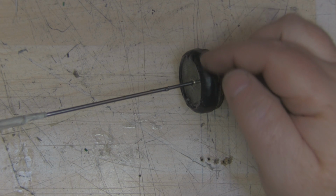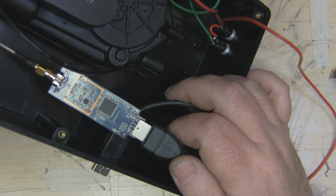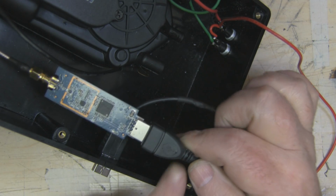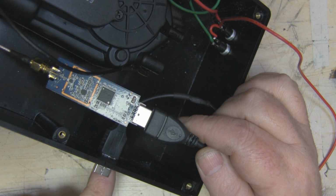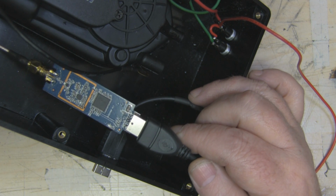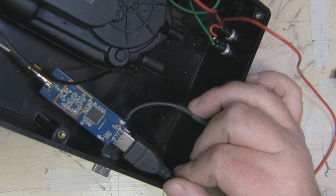What I'm going to do now is put a little bit of epoxy around the sides of this and attach it to the helical, just like I did at the feed point. To connect to this, I'm going to use a Wi-Fi card because it's much easier for me. You could easily add a receiver for FPV if you wanted to, but I've just got it connected here with the SMA connection, and I've made this short pigtail of USB cable. I've cut a hole in the side of the project case, so I'll epoxy this to the case itself, and I can connect an extension cable on there to power and use the USB card. The 12-volt battery will just be there to power the car aerial itself, for extending and then retracting the antenna.